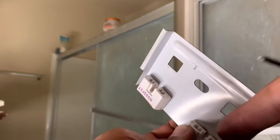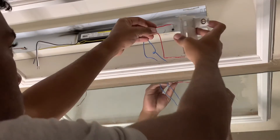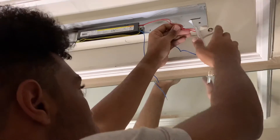Once you pull out all four wires of the fluorescent light socket, make sure you check inside the pin connections to verify there's no copper sticking out. Buying a new ballast doesn't come with replacement light sockets — you have to buy them separately. You should buy new replacement sockets along with the ballast to reduce issues and avoid breaking wires. Just twist to make the wire come out loose.